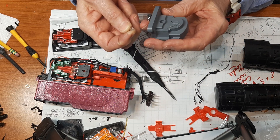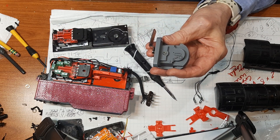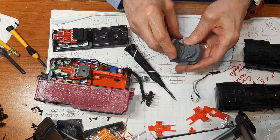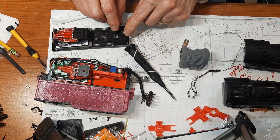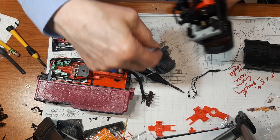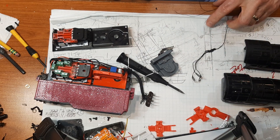I've designed the fireboxes for the lens of the Alco diesel — the lens will cover that and serves as a diffuser, making it look more like a glow rather than three lights. When this is going down the track it looks like the fire is going in the firebox — it's really neat, plus you're hiding the motor and whatever else is up in there. I typically run all my wiring down underneath and bring it up under the motor. Instead of plugging it in here, I run it up in here, along there, and then up between the brushes, then distribute that wire out — that's where you can wire in your lights as well.